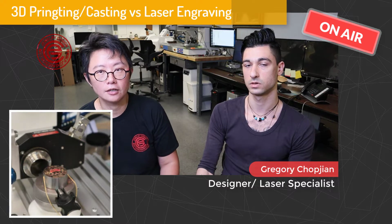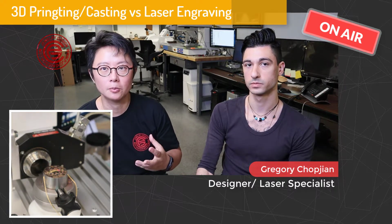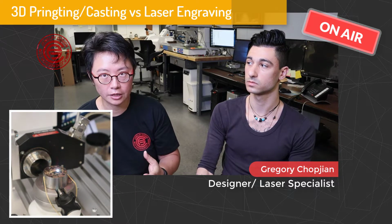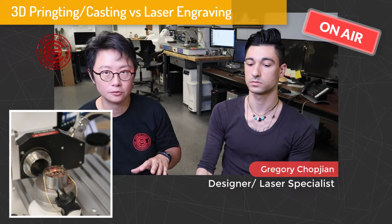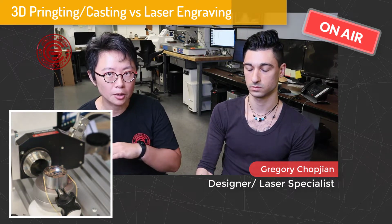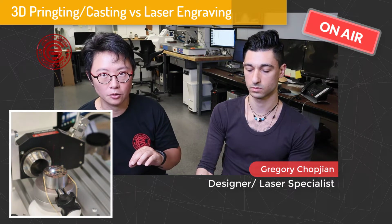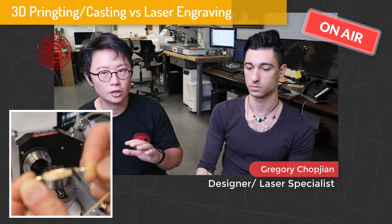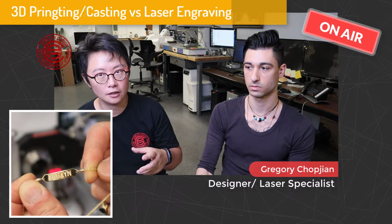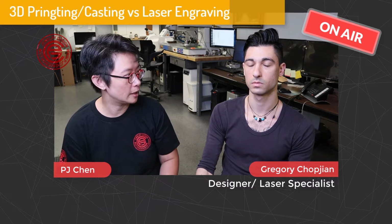Right. So if you are a CAD designer, you might want to think about what is the best outcome, whether you're going to do 3D printing or laser engraving, if you want to have an image on top of it. If it is completely flat, laser engraving comes out with really nice detail. But if you have some sort of dome surface, you might want to build it in the CAD and have the casting do that dome surface to have a better result.